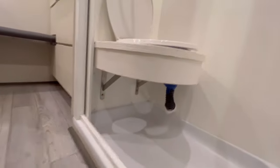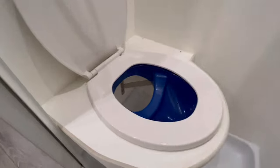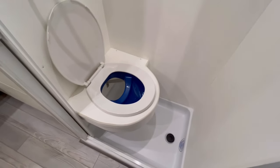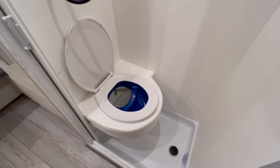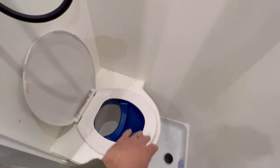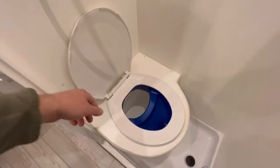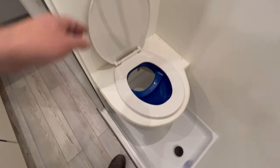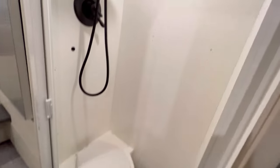The toilet's pretty cool. Underneath you can see there's a Hepvo valve which stops any gases from coming back up, because this is a hand-built urine-diverting toilet. I did this in my very first build and since then we've done a lot of composting toilets, but I've had a lot of requests for this lately and I do kind of like it. The urine goes in there and then you can put a bucket with a bag below for solid waste — wrap it up and dispose of that properly. It's a 36-inch shower pan.